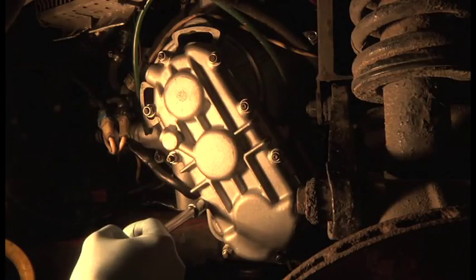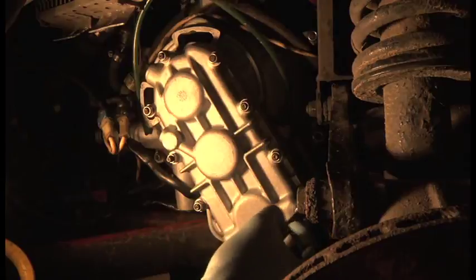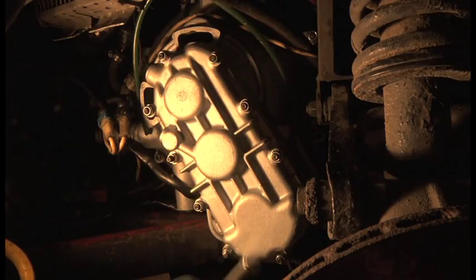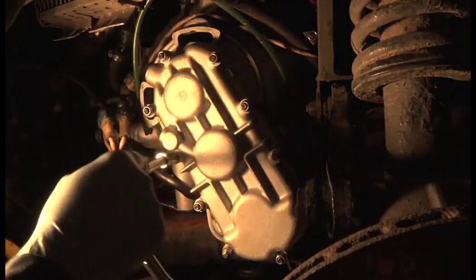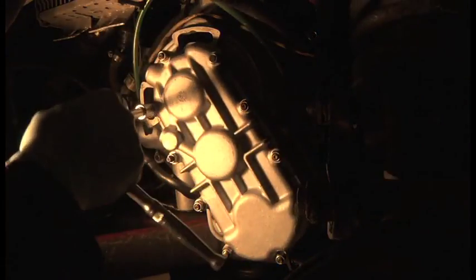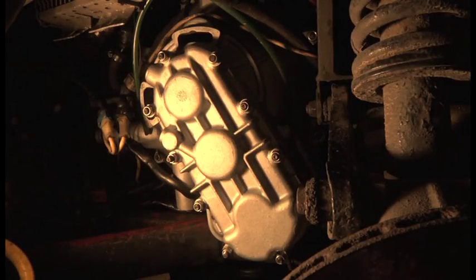So you're not putting a lot of torque through it, because they're only little studs. They don't take a lot. It won't take a lot to strip them out. I know I keep going on about this, but the aluminium's very old on this, and it's quite soft actually. I'm quite surprised how soft it is, relative to Lotus, where the alloy seems a bit better, dare I say.